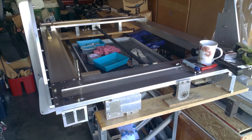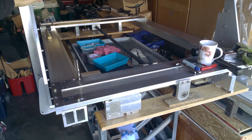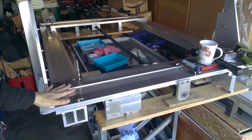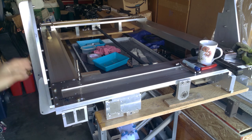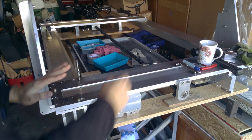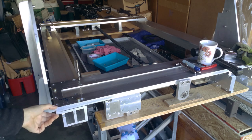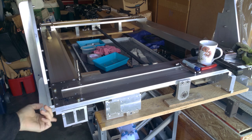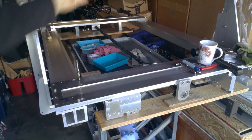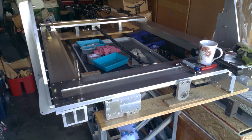I'm happy how the machine's going together. I have the frame together and I have the gantry together - right now the gantry is attached and the frame is all bolted together. I used this gantry plate that goes across to make the two rails parallel, then I adjusted it in but that doesn't mean it's square. What I'd like to do is get the machine square as well. Doing a rough estimate from the corners of these rails, I think it's within two millimeters diagonally. I want to see if I can get it within one millimeter.